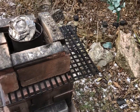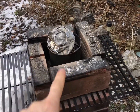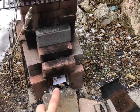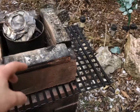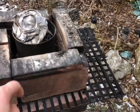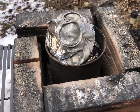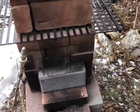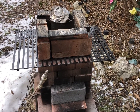My last attempts using wood to melt aluminum haven't been really successful — it started to melt, just started, but not enough. So I made a few modifications to the rig: put more wood in, took the layer off since the bricks aren't glued, put the grill here, and put the pot with the blue metal lower and more exposed. I'm going to get this going and hopefully melt it.